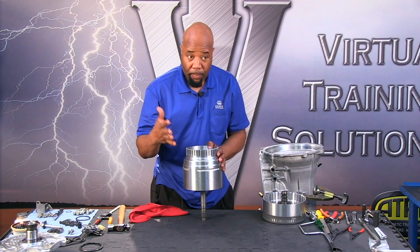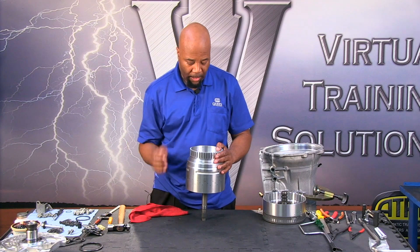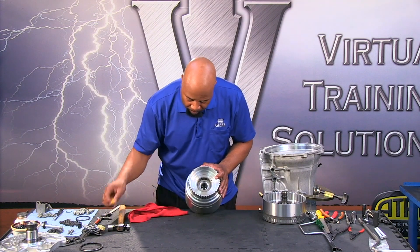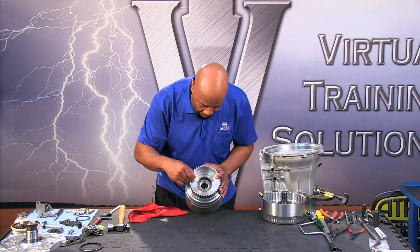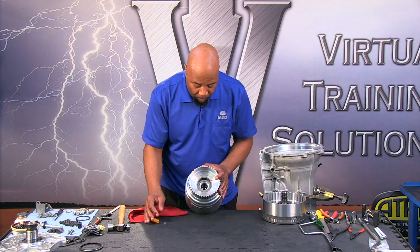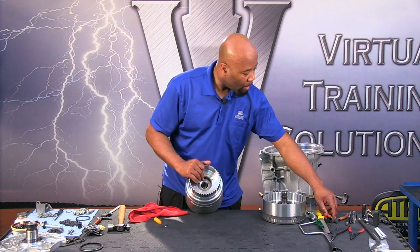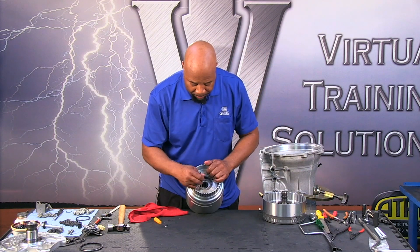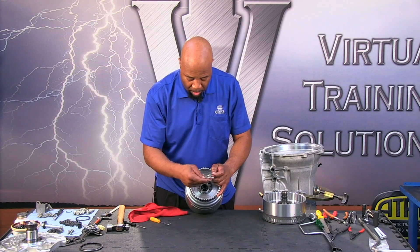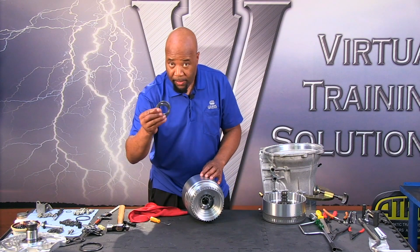You've got to get a good grip on this — it doesn't give you a whole lot of territory to work with, but it's a good handle in this area. We do want to inspect this drum. There is a seal in this area — a bearing and seal type combination. If there is a rip or if the seal is messed up, we've got to replace this drum or service this bearing seal assembly. There's also a bearing and a thrust washer we want to account for — two components we'll talk about more on assembly.